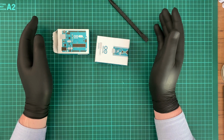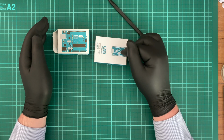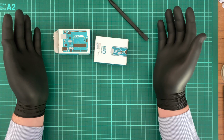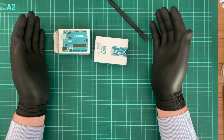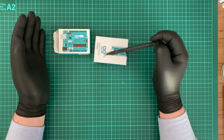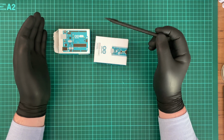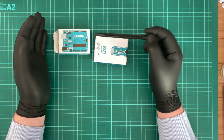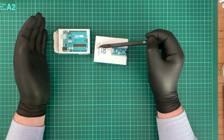The major difference between these two is that this one doesn't have a crystal oscillator and this one does. For you, probably not going to mean too much, but if you're going to have this thing running 24/7, 7 days a week, or in an industrial application, you actually do want to stick a crystal on here. It's going to cost you a little bit extra, but stability helps. Although you probably won't notice, and I'm just talking from other points I've seen online.